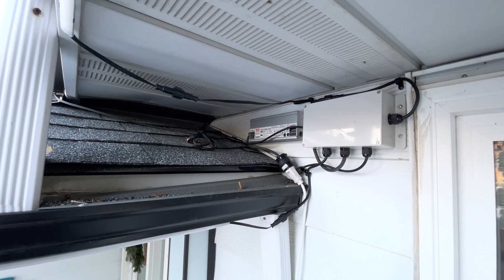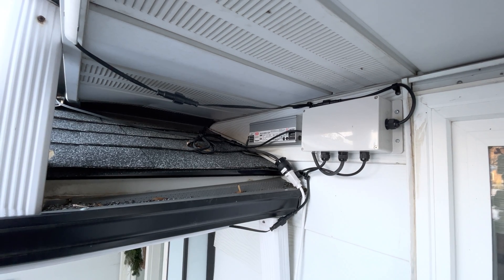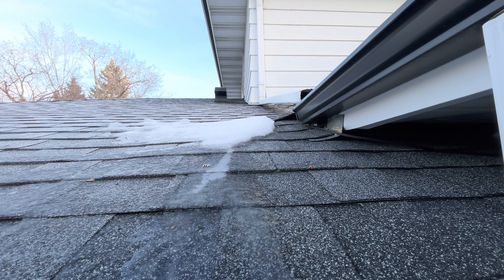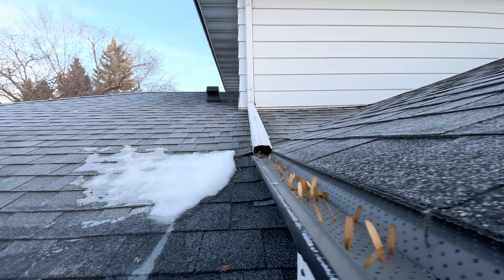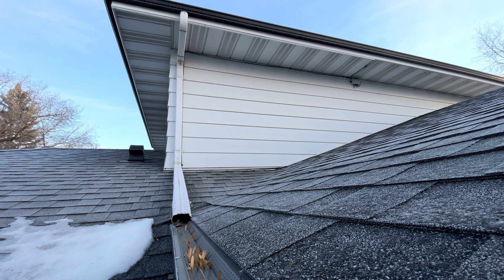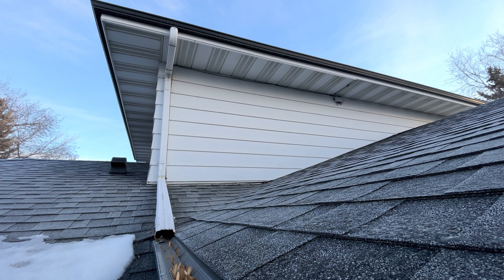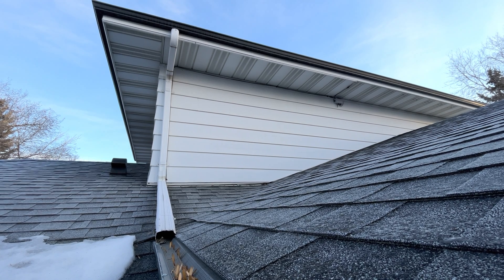To get power to the upper roofline I'm actually running power only to a dig uno that's located under the soffit on the upper roofline. This cable is a 16-2 landscape wire. I run it outside, along this little eave up and then along the back wall. I'm not going to climb on the roof because I don't want to die today, but you can see up there there's another box, and from the street and even up close below this is very unnoticeable. You're going to have to hide it differently on yours but trust me there's a lot of places you can find to hide things.